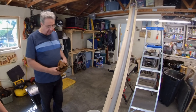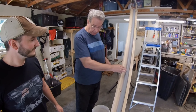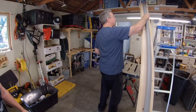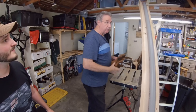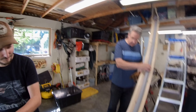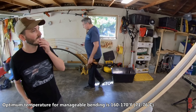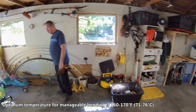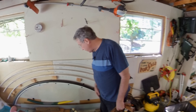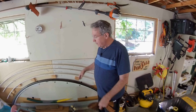So what we've got is a one and a half inch PVC schedule 40 pipe which we make our roller coaster rails out of. I've capped one end and I have a little copper funnel sort of thing that we're going to pour hot sand in the top and hopefully get most of it in the pipe. Once it's full of hot sand — up to 160, 170 or so — then I grab it and move it over, cap the top, grab it and move it over to one of these forms, the tooling on the wall that make different radii. You can see one's done here — lay it on there, put it in and just let it cool down.